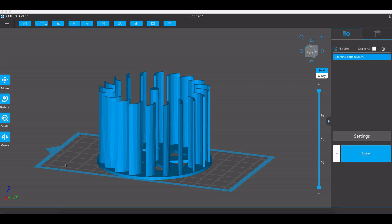When you drop this in it drops straight onto the bed plate as if it were a filament printer. Filament printers and resin printers are slightly different in that resin printers don't like the large foot plate like this — if you put the part straight on the bed plate, that bottom section is exposed the longest and there's a tendency for it to be slightly larger than the actual part that you design. There are things you can do about that: just accept it when it's non-critical and carve it down, or muck around with the settings a little bit.